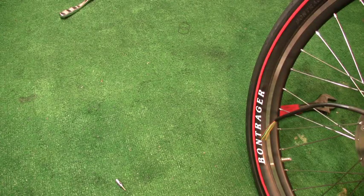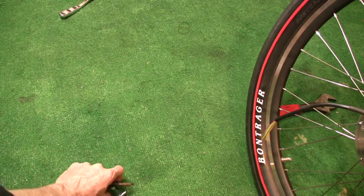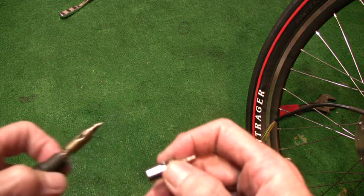There are times when you want to solder heavy wire together and an electric soldering gun, like the 150 watt variety, just lets you down. It just doesn't put out enough heat. Plus the ones they make today are inferior to the ones of 30 and 40 years ago. They use aluminum barrels instead of copper or nickel plated brass, and the connections are just not good.